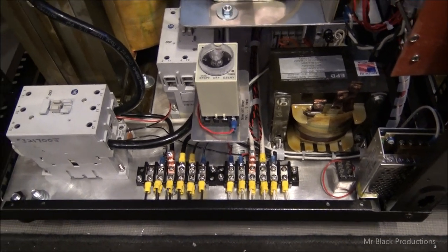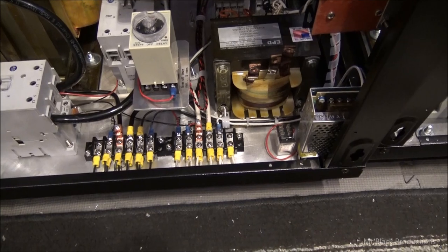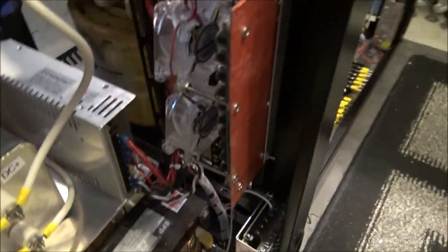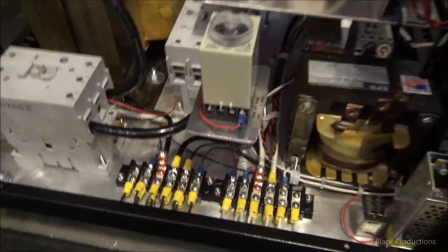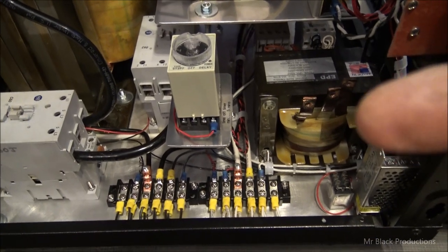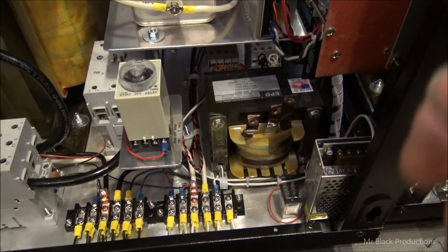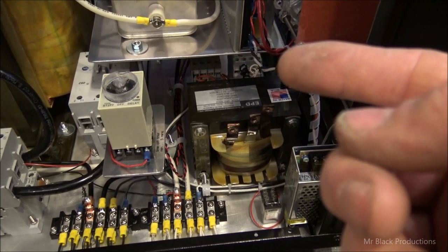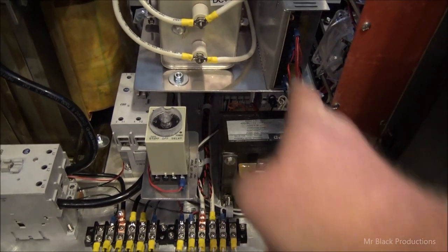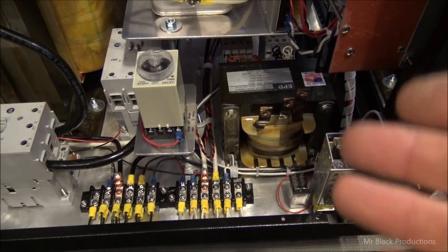Well, instead of sitting around for hours on end thinking about the amp deck, I thought about the amp deck while I was completely populating this thing out. I'm missing one wire off of each one of these, and it goes from here up to our bias board, which we've now mounted and installed, manufactured and wired in. Everything has a label on it, like time off timer, minimum 5 minutes. All my control interfaces are wired, and I've got wires run up to the front of the cabinet. So all you've got to do is provide it a case ground, flip on one switch, and it'll activate this unit, which will click down the contactor, which will in turn turn on the DC sides of the amp and allow us to have keying function, and it'll bring all the blowers on. Everything is tied back to that switch.